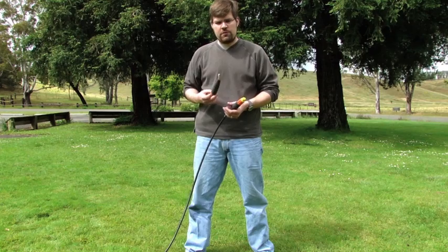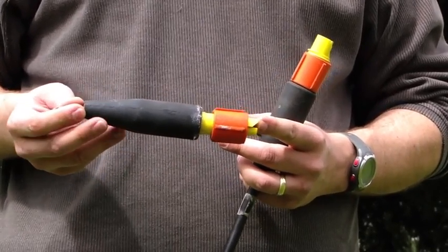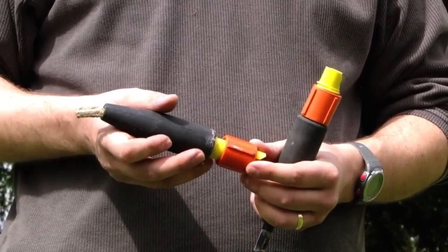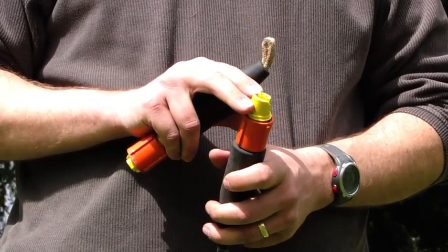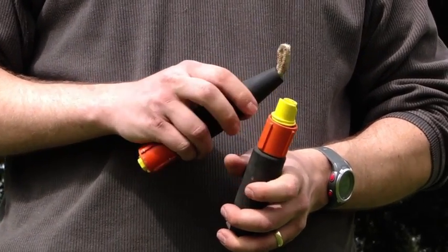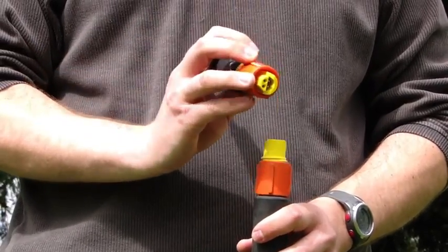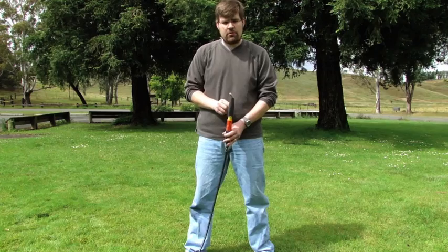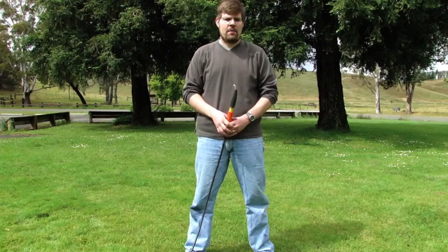The transmitter has two special adapters called shorting plugs — it's a short little piece, and it is a safety device. This transmitter can put out a thousand volts at a milliamp or two, so we want to keep you safe and protect these contacts, making sure you cannot accidentally touch them. The transmitter has circuitry that forces it to only run if this shorting plug is connected onto the transmitter dipole cable. You need to have a similar shorting plug on each end of the transmitter dipole cables.